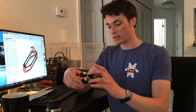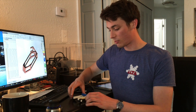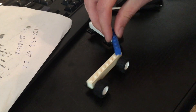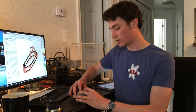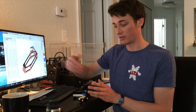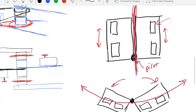What I ended up with — and I've got a Lego demo here — is a basic concept to split the robot into two halves, the left and the right half, with a pivot point in the middle. This lets it drive on four wheels forward and backwards like a normal robot, but also lets it pivot open so it can strafe side to side. When it's pivoted open and strafing, it strafes in an arc, so it could open up, drive sideways, and circle around the opponent to quickly get to the backside where there's not a big scary weapon. Right here you can see the split robot design I talked about and showed with the Legos.